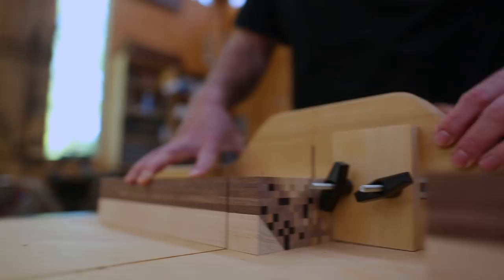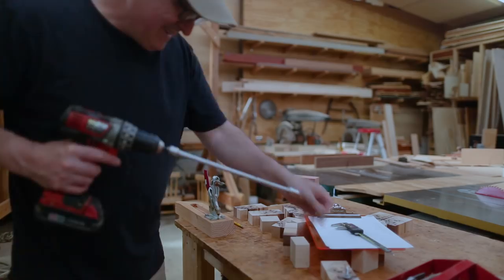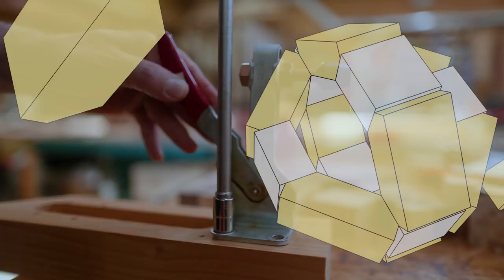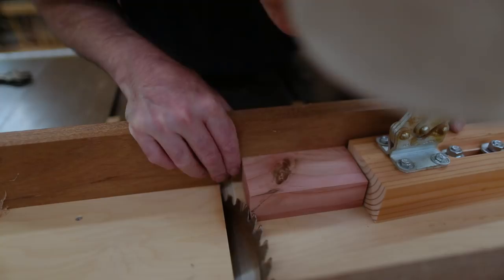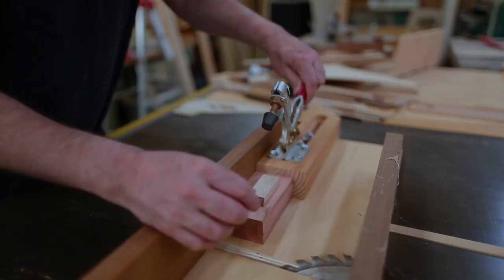Now I made up some dummy pieces to sort of practice on for the next step. I need to cut a 45-degree angle into the pattern pieces. Because of the geometry of the ball, the pattern pieces need to take up the angle of the ring, and the square pieces need to remain straight — parallel on the sides — because the rings run in three dimensions. I practiced this on my dummy blocks before I cut into my sacred pattern piece that I'd put so much work into and didn't want to screw up.